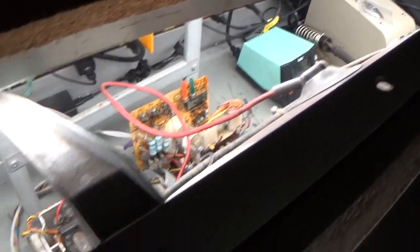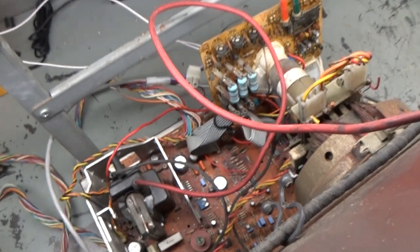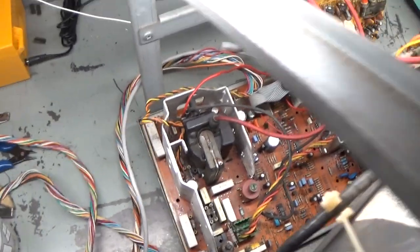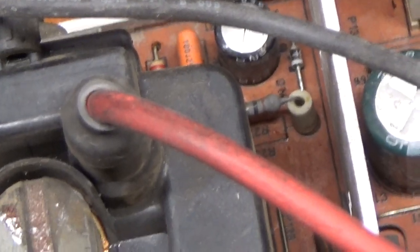We got smoke. And we have a cap that just exploded. That guy right there opened up its top. Why did that happen? Yikes. Well, the smoke cleared out pretty good, but that pop was that cap. I don't want to put a new cap in and have it blow up again. But that cap could have already been bad from the flyback arcing. So,